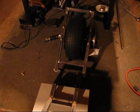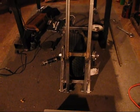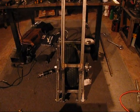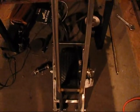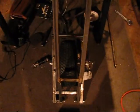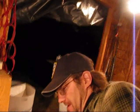Because if you make the same mistake I did, when you go to fold it up, it will be offset — the frame actually goes up at an angle. It's still going to work obviously, but the frame is slightly crooked. So yep, stupid mistakes. She'll crab walk a little bit. I'm sure I'm not the first one to make some dumb mistake like that on a build. There you go — thought I'd point that out. Alright, take it easy.